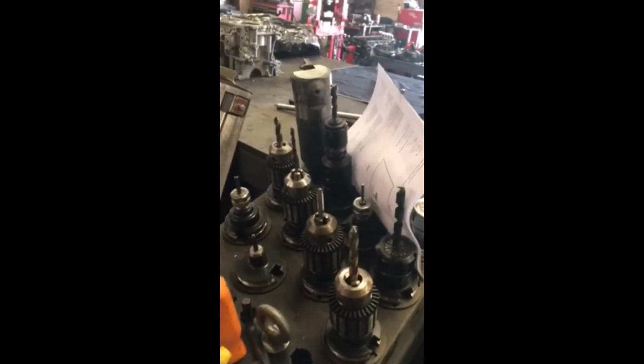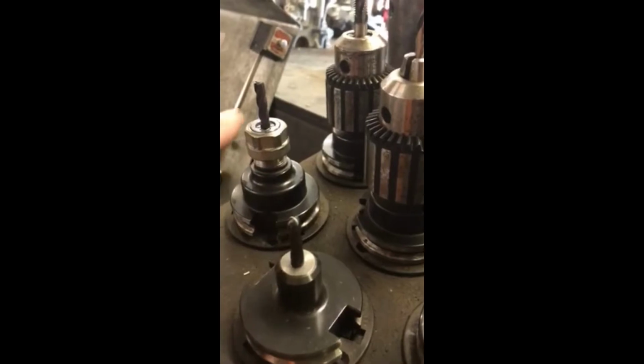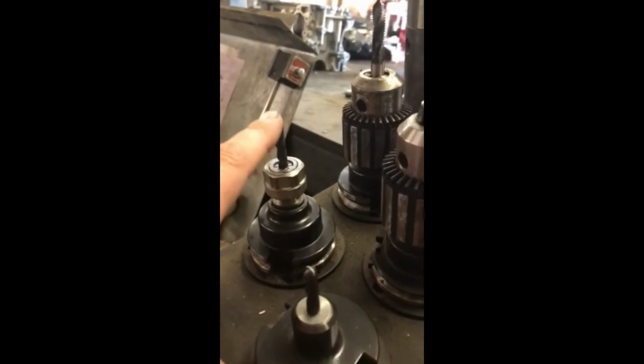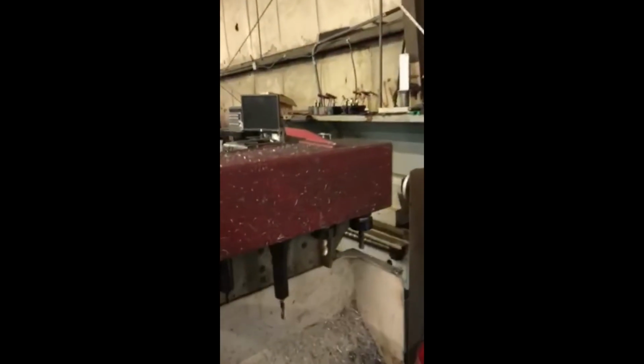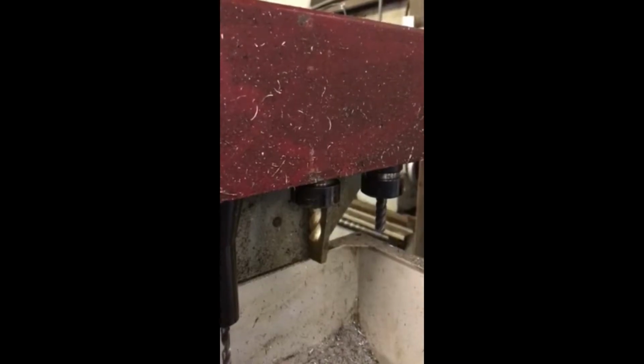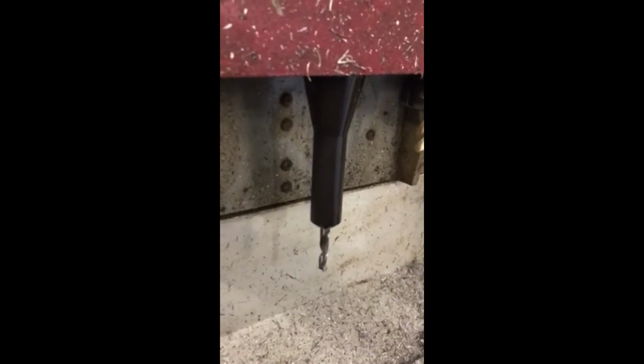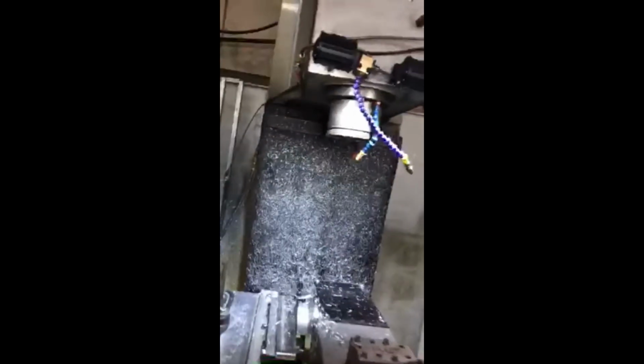And then I've got our tools set up. Let's see, so that's my ball end mill I use. And there's my new 4-flute I set up, so I'll have to set the height of this one. There's my drill bit for the number 8 screws, I think it is. And then I need to set up still that. I've got to change that one out to my helical 3-flute for titanium. That 5-flute half-inch on the end is already set up. 5/16 carbide drill setup. So yeah, we're ready to go.